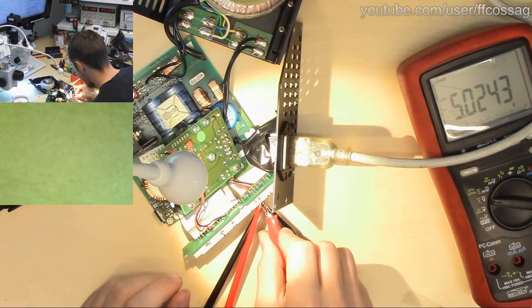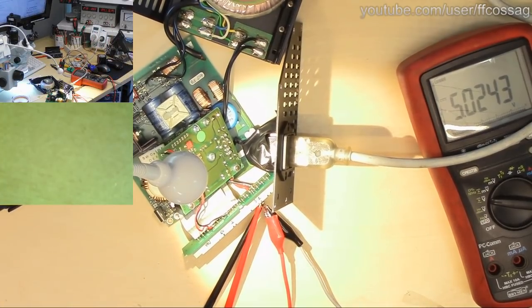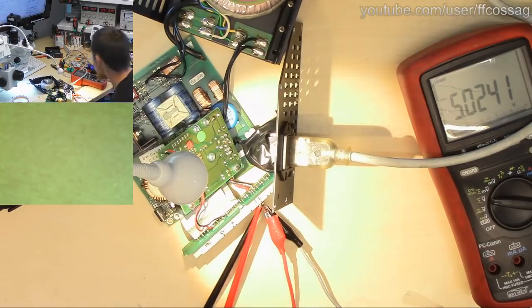I think there's going to be a reasonably fat output since we have very thick wires going to it. But we'll start at 100 mil. Now that's fine. Let's jump straight up to 500 milliamps. It's fine. 1 amp. Not 10 amps, 1 amp. And it's dropping a bit. Let's do 2 amps, see what it says. And it current limits. Yeah, it just current limits nicely. I can hear it switching as it's supposed to be. This is behaving very, very well.